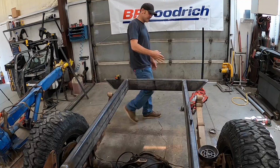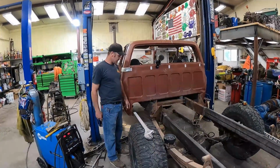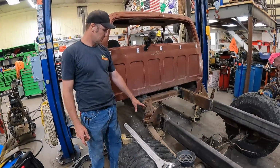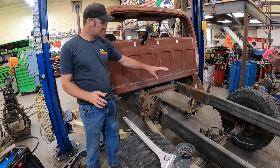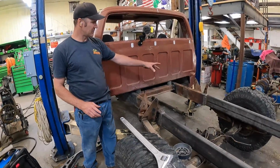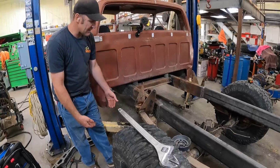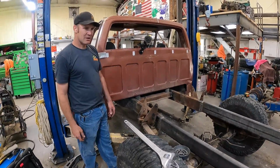Really wish we would have done this properly. I know. All right, rear end's kind of setting under here. This one is where we want it right now. So I'm gonna go ahead and tack it in a couple of spots right here. And then we'll roll that side forward. We made a mark where it needs to be. Then these ears are gonna get trimmed off flat, and then we can deal with our back that we made too long.